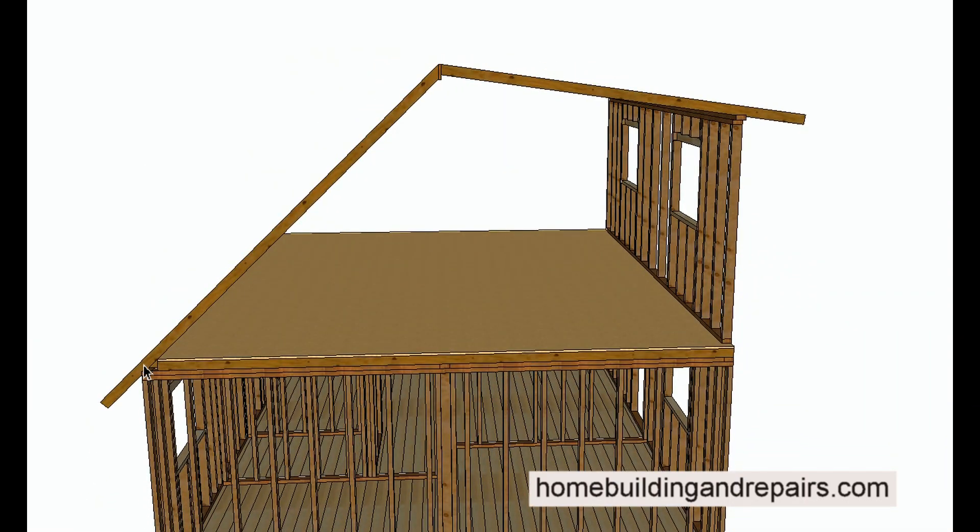If you have a roof that goes up and then comes back down, you're basically creating a structural member that will hold up that section. The weight of the roof will transfer down and create a nice structural component, especially with the ties down here. Once you do something like this and start to put pressure on one side of the roof, you're actually going to force pressure on the other side, which could create movement and cause a wall to move — and that wouldn't be a good thing.